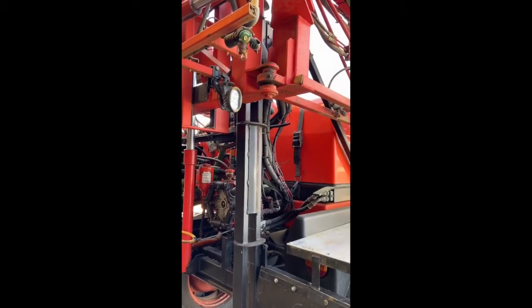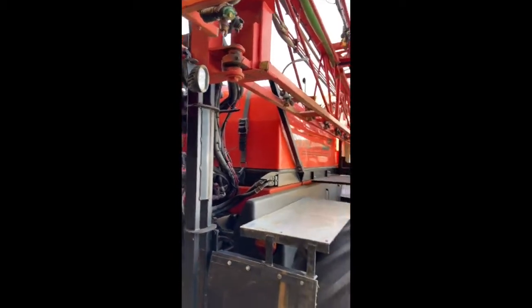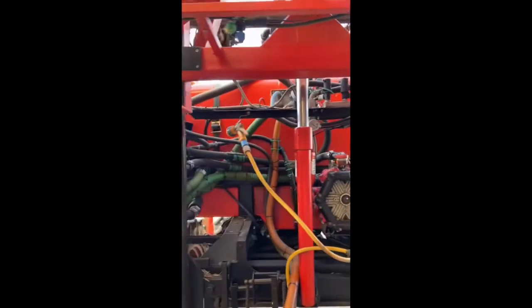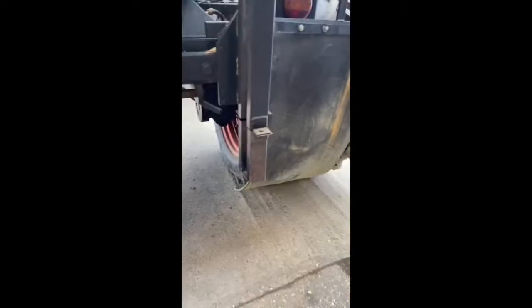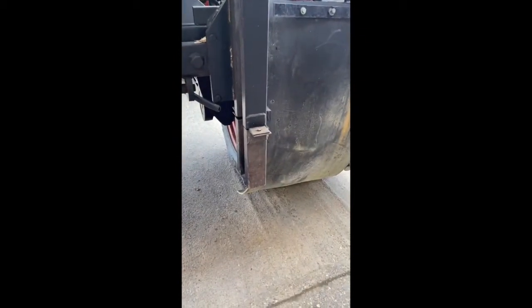We've got boom lights for spraying at night — they're a really cool nice blue light so you can see all your nozzles working at night. Triple nozzles, standard single line. I do actually take the bottoms of the boom rails off when going through a road — little extension pieces taken off with a plate put in to keep the strength, and then put back in when you need to be a bit lower for pre-emergence in the autumn.